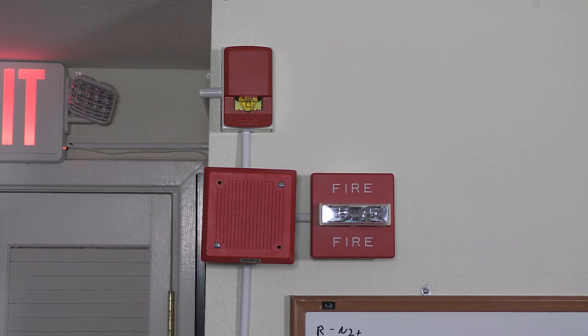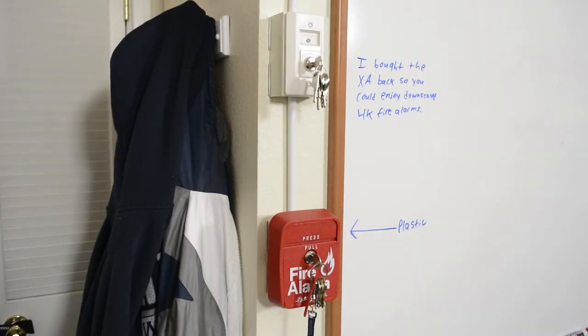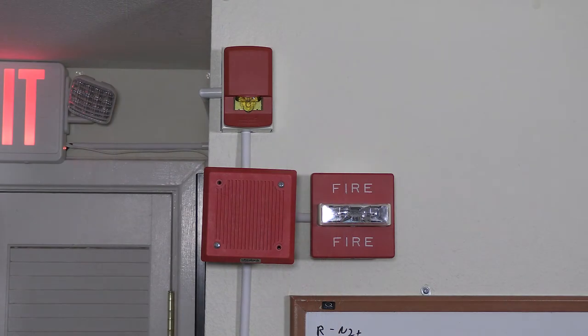That's definitely one of the loudest in my collection. For the purposes of the demonstration, I have both the horn and siren tones wired at the moment. For the horn tone, it will be obvious that we have it set for a fire alarm activation, which the RSS will activate for and will also be performing Wheelock sync audible silence. The horn is set to temporal coded by the panel, so when we activate the LNG-1R, that will activate the AES in horn mode. Then we'll transition over to a supervisory activation with the key switch, which will activate the LED Exceder and set off the siren tone of the AES, demonstrating that the same alarm can be wired for two different tones at once — it depends on which input you activate.